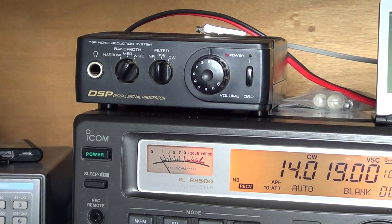Two types of DSP are available. Most digital signal processors today are in-board, meaning the radio already has the signal processor inside its electronics. If you look at high-end receivers today like the ICOM ICR-9500, it has a digital signal processor inside the radio itself. These are very powerful — basically computers processing signals so that you have maximum clarity. In-board DSPs also give you a very wide range of tuning and almost limitless selectivity filters.